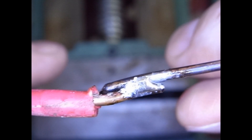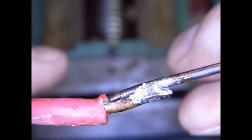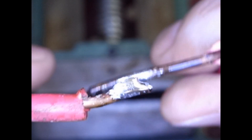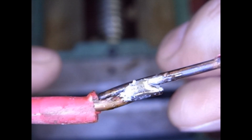Also, this is another reason you want to have a good mechanical connection. In case the solder fails, at least the wires will be held together — they won't go springing apart and short somewhere. A good mechanical connection is not a substitute for good soldering, but on the other hand, it's a good safety thing when the solder does part.